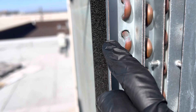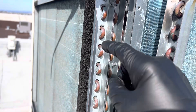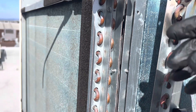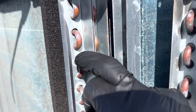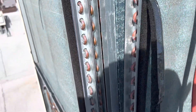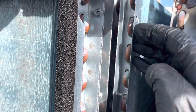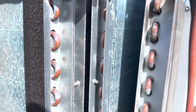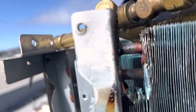Right where you cut through the metal, you've removed the galvanized. You can see the edges are all rusting, and those edges are exposed to the copper. So you have a direct galvanic electrolyte with the salt in the air. Every night here in San Francisco, the fog comes in with salt and water droplets eat away at the copper — it's just set up to self-destruct. No manufacturer should be putting out sheet metal like this; it should be hot-dip galvanized, and all these ends should be sprayed with either epoxy or zinc.